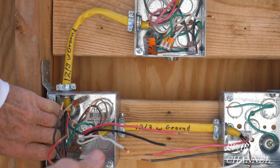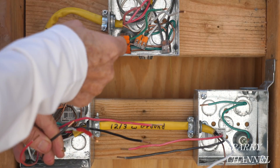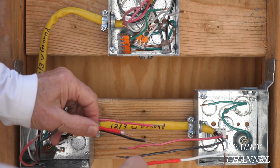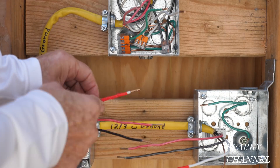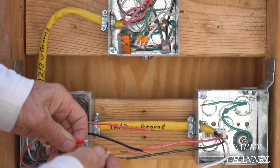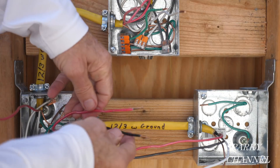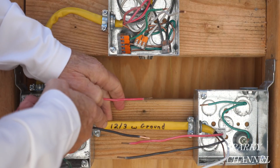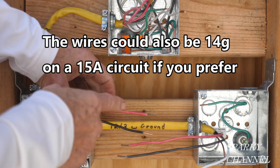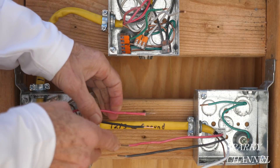I'm going to use this other white wire as a hot wire — it's hot all the time. Remember, up at the light box the black wire we hooked together and brought it down here, so it's hot all the time. I'm going to use this white wire as a hot wire; I've got it marked with red tape, and I'll show you NEC code 404.2C later. These two wires here are what we call traveler wires — they come from this 12-3 with ground cable, the red, black, and the white we're using as a hot. I'll show you that in just a moment.